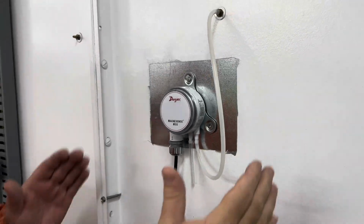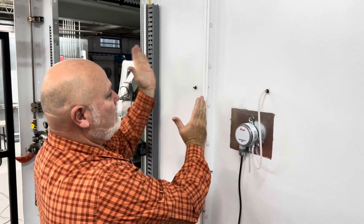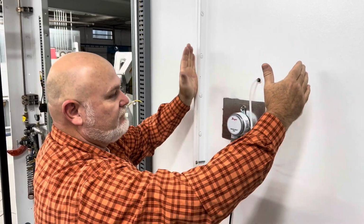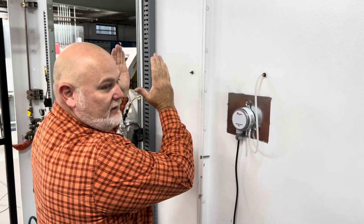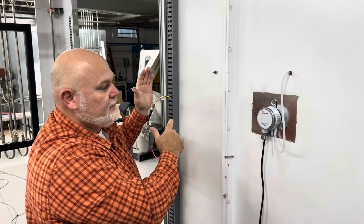What that means is this chamber here, from here back, is where our exhaust fan is. Our filtration is here forward. So this is the negative pressure environment. This is behind our filters, between our filters and the fan. That's the negative pressure side. The positive pressure side would be the booth, spray booth environment itself, or upstream of the filtration.